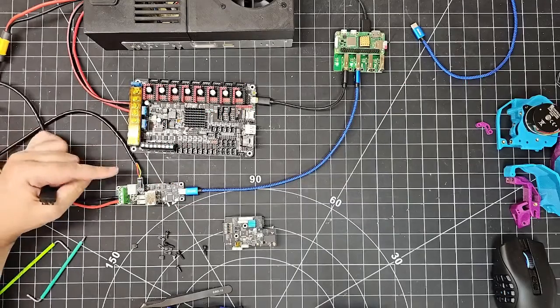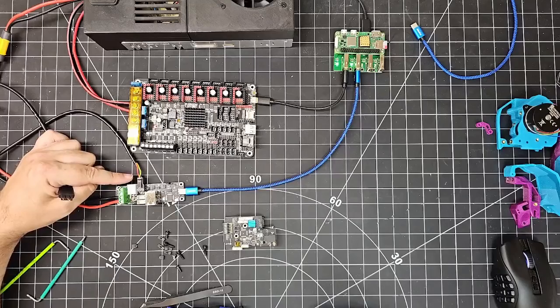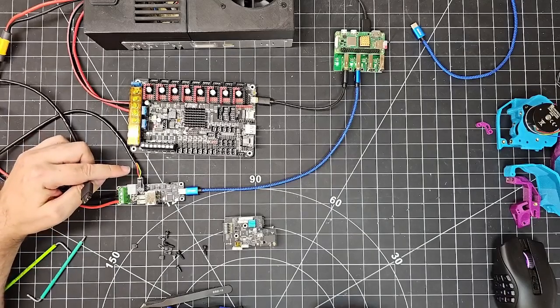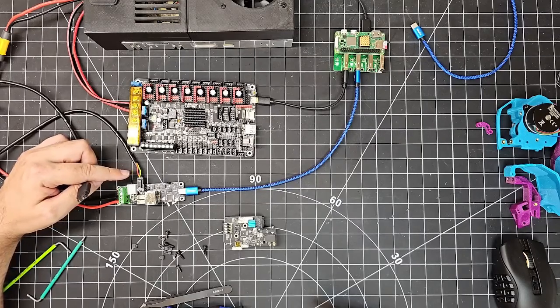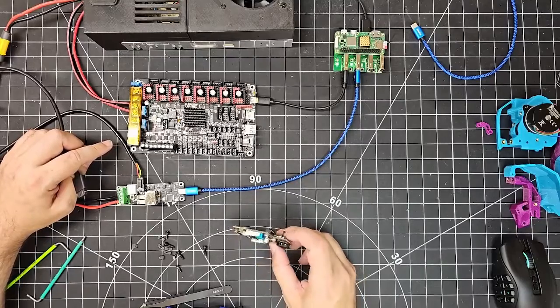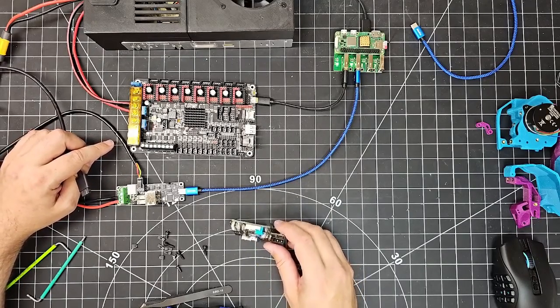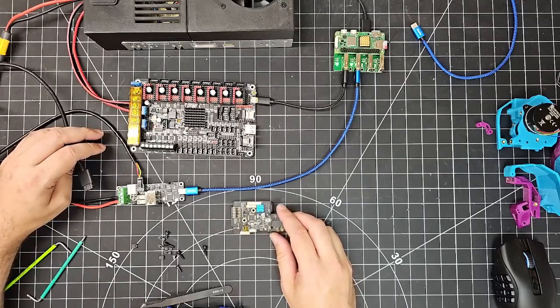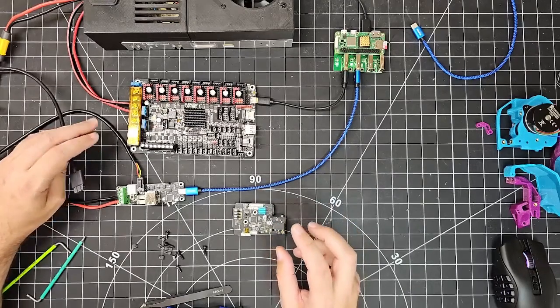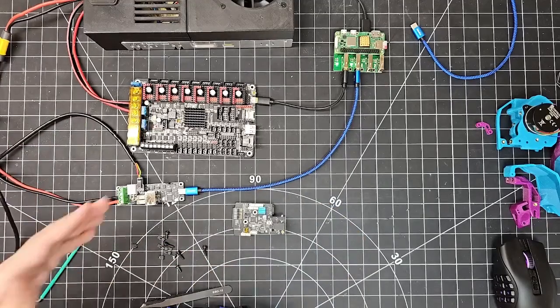as mentioned, I previously had crimped the Molex Microfit 2x2 connector that connects to my U2C onto the appropriate wires. And I've made sure the wires are in the correct orientation. Again, orientation is important here. So make sure to check pinout wiring diagrams to get power and ground and CAN H and CAN L into the right pins for whatever you're connecting it into, whether that's on the U2C side or a CAN bus adapter that has a Molex connector or just bare wires. Just be careful to get the wire order correct, because you don't want to short the board, or power the board incorrectly, and then have a blown up board in your hands. In this case, I'm fairly confident I got it right, because I was using this cable previously on another setup.